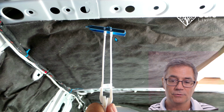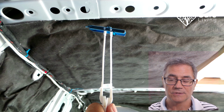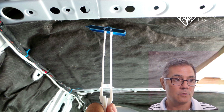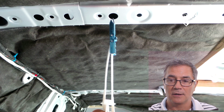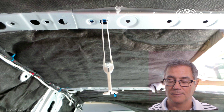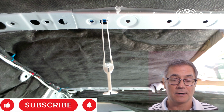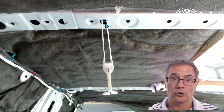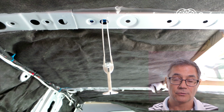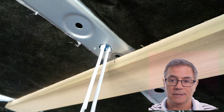But what I did is I used these toggle bolts that I have the link to on the Amazon website. These actually go into the ceiling. When you stretch this out, they go up into the hole. You pull these 2 plastic pieces down and make them even, and then you're set to receive a bolt there. And here I used 1/4 inch, 20 threads per inch steel studs, so that I could screw them into there, and then I have a nut on the other side. We'll get into all that later, but that's really what the preparation was.